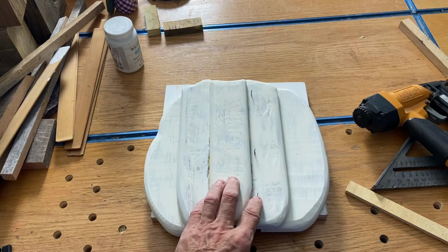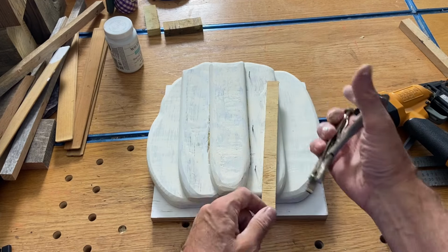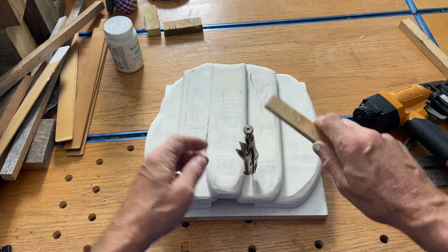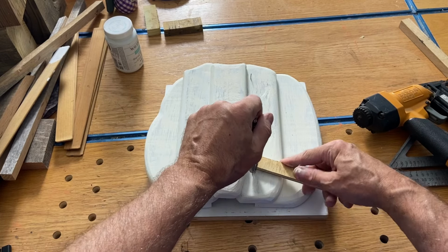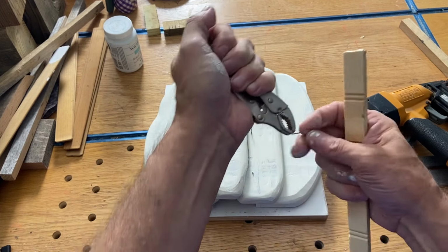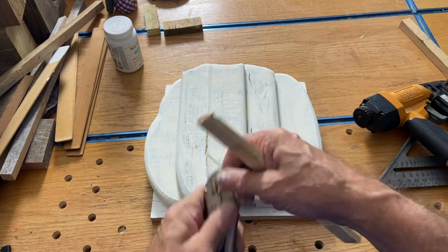I'm gonna pull these through, and there's tons of different ways to do it, but this is what I'm using. Vice grips, you just set it just tight enough to stick it on there. You're gonna wanna have some type of a backer just like this. Maybe a little thinner than this one. Take it out as gently as you can, because the head's gonna try to pull out the material. And now I got some holes to patch.